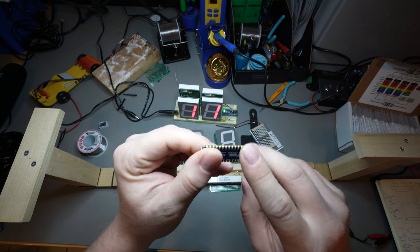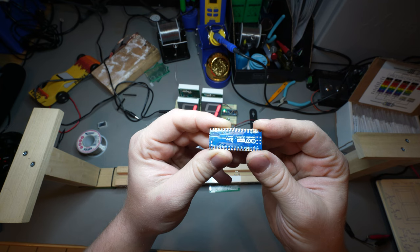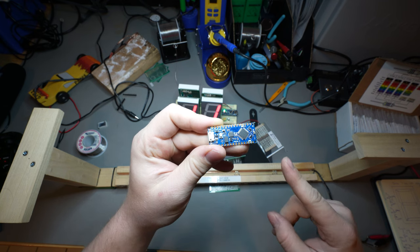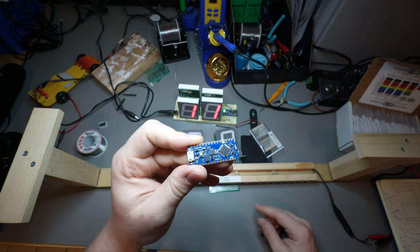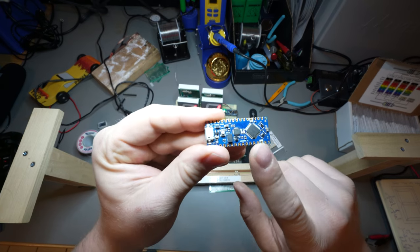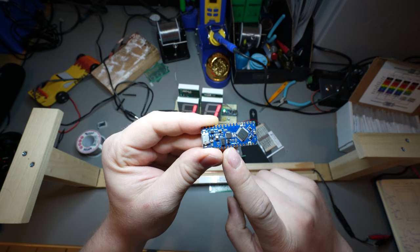And each of those rails have a pin that you can use some power if you wanted to power some things from there. I looked up the documentation, the 3.3-volt rail can have 550 milliamps to whatever the heck I want. The 5-volt rail can have 950. So this current system on 3 volts is right about 550 milliamps, which means if I powered it off the 3 volts, the LDO on here would just be cooking and probably fail.